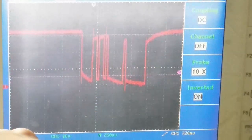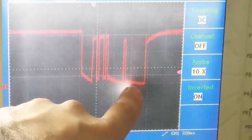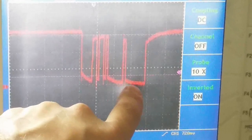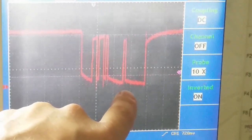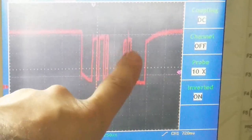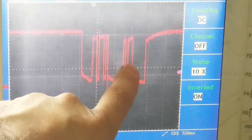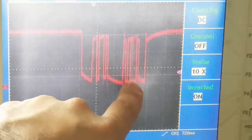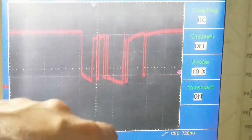So I'm going to change the knob, and you see all that activity here? We're sending different values. Right now we're sending a 0, and everything's down low. And then as we send the value 1, you see a value goes up to 1. That's the value 2. It's in binary, by the way. That's 3. Now we'll go to 4, 5, 6, 7, and so on up. So here's the maximum value. I just thought that would be really interesting.